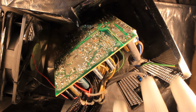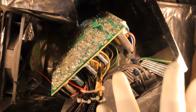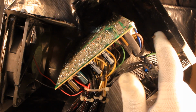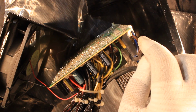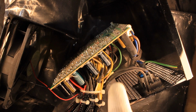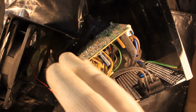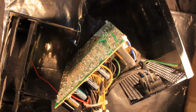So the situation is that these cables, which are the mains inlet power cables, so this one is going to the power switch right there, and this is the main power inlet. Those are the 2 cables, and that's the grounding wire. These are not seated in any kind of removable connector. They are directly soldered into the PCB, and they are quite short. So in the next step, I'm gonna desolder these with a high power soldering station, so that we have physical access to the board, because right now from the 2 metal pieces there is just no way to get to the real components themselves.